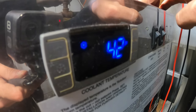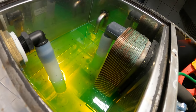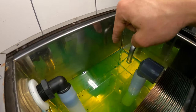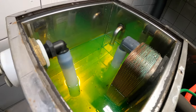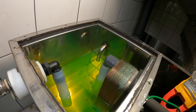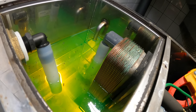The refrigeration system is at 42 degrees. That means this water level is 42 degrees as the sensor is right there. This is the heat exchanger — look at the water level in there compared to what covers that heat exchanger. I feel like we need more water here. It looks like there's a marking about the level that was here. I can also see a little leak right here — we're losing glycol, so it would make sense that we need more water as it's leaking out. We're only using part of this heat exchanger to actually cool this down.